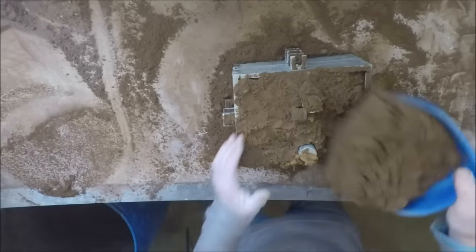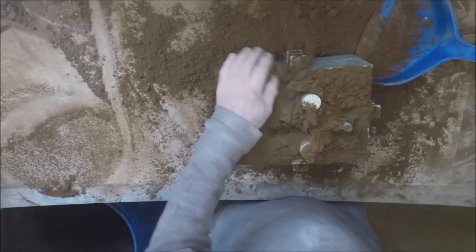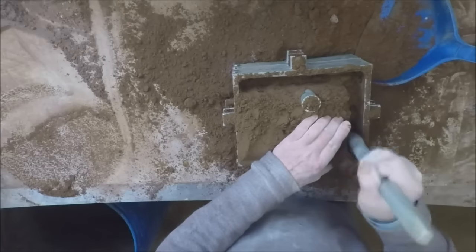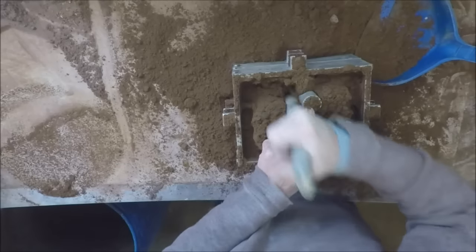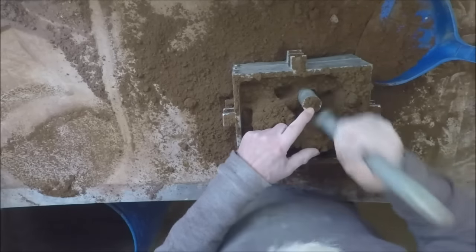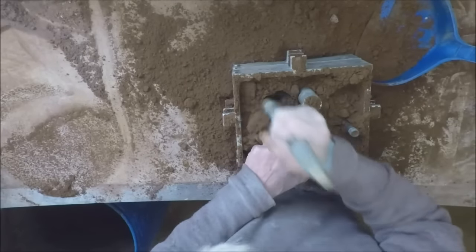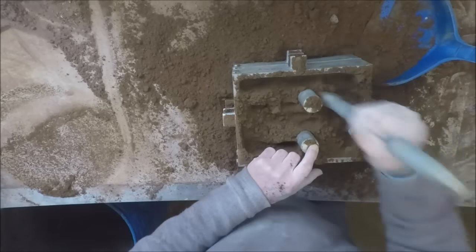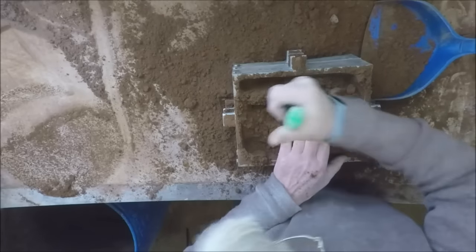A little more than that, I think. Barrel's getting a bit empty. Right, stand the screw up. Here we go. This is a pretty easy, straightforward ram. I've just got to remember where that cotton reel is because I don't really want to smack the top of that too much. It's just down there, so I'm around it. That's pretty good. Turn up around the sprue and the risers.